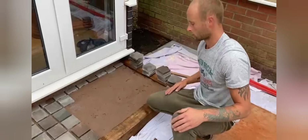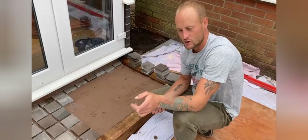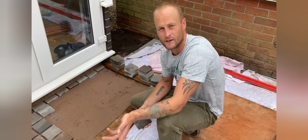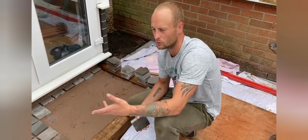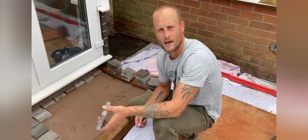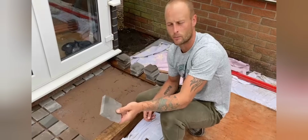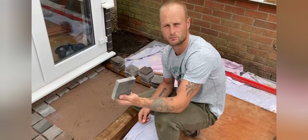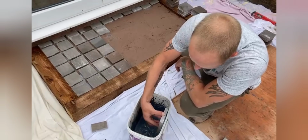What are you saying about this step? Very, very nice. What we've done here, because of the bond on the slabbing, I think personally that putting a slab in, two slabs there, we worked it out for two slabs, but it'd break the bond in the slabs and it perhaps would look like it wasn't thought about. So instead of chucking all the slivers off the cuts that we've had in the tip, I said to Dean, why don't we just cut 100 by 100 little cobbles, because you buy these in cobbles, which cost you a fortune. So we just spent a bit of time this morning, cut them, mark to mark, laying them in, SBR on the bottom, like that, in there, scrape them up the side.